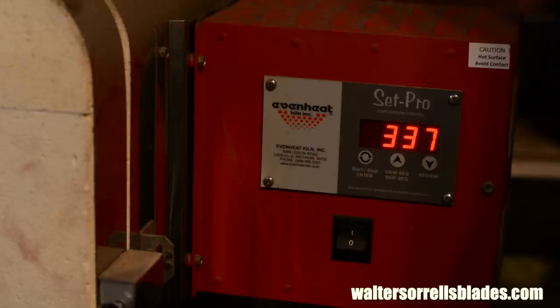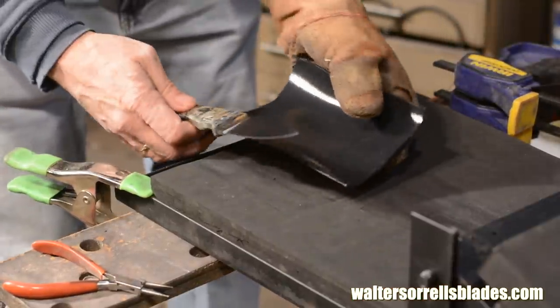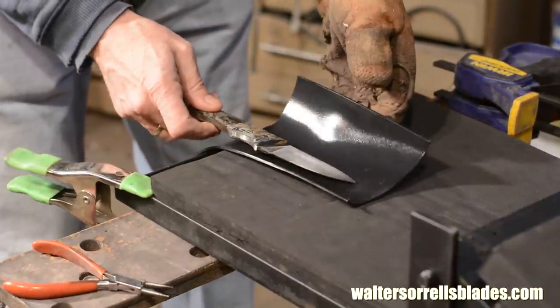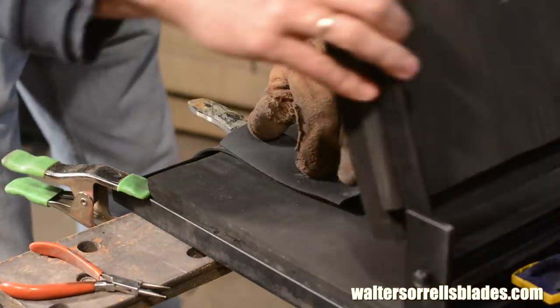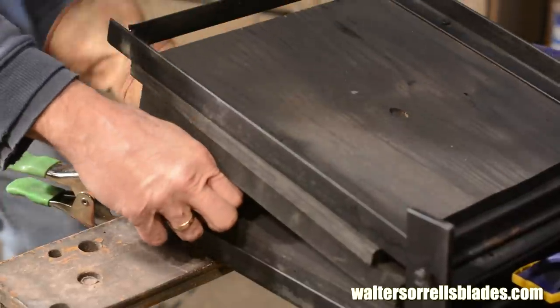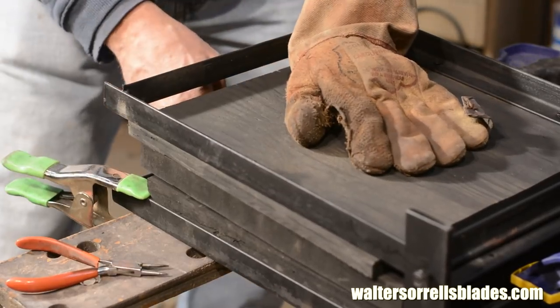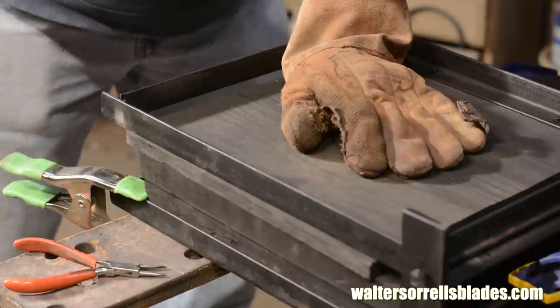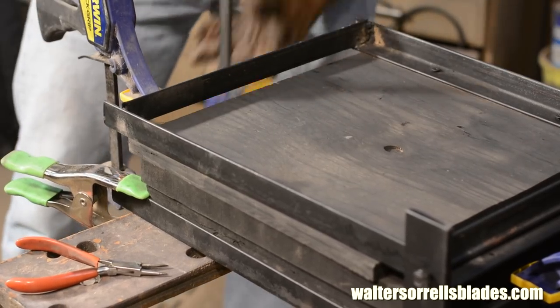You just want to keep an eye on it and make sure you don't let it burn. Once it starts sort of rolling up around the edges, that usually means it's ready to go. You want it to feel soft and floppy — about the consistency of a cooked lasagna noodle. As soon as it's ready, I'll take it quickly to the press. I always leave the knife sitting there on the press in exactly the position that I'm going to use. Don't forget to make sure that the textured side goes down. I lay it out quickly because the material loses heat fairly fast. I pull and adjust and yank a little to make sure the spine of the blade is right flush up against the crease. Then I close the press as quickly as possible, adjust a little more if necessary, and clamp the crap out of it.